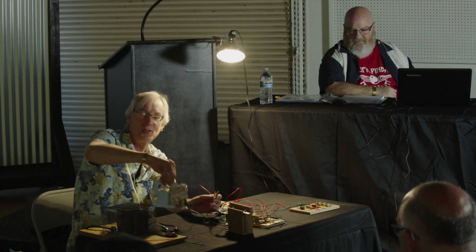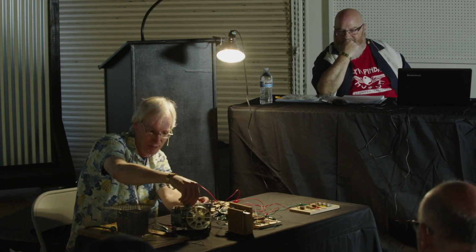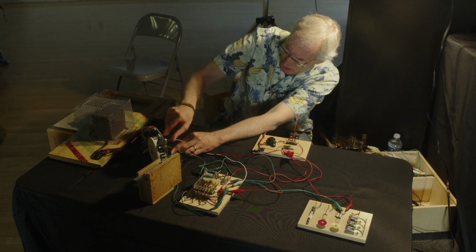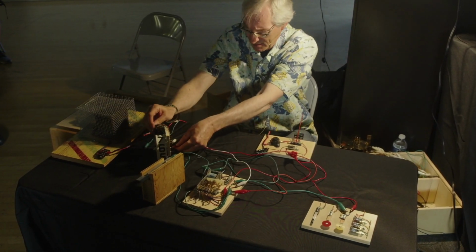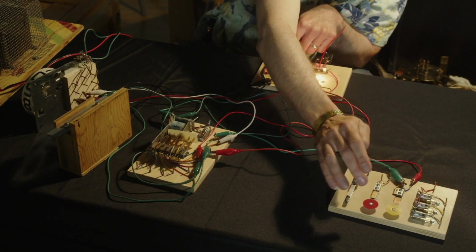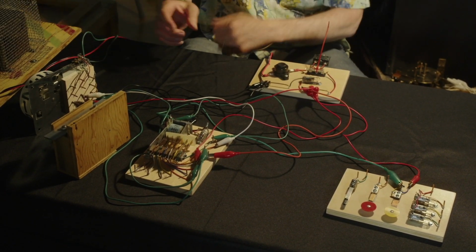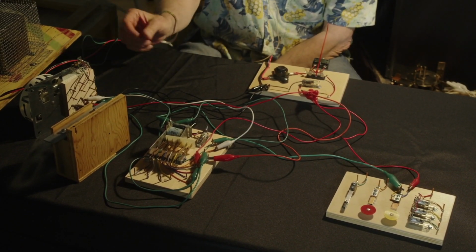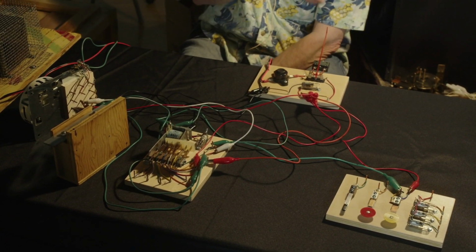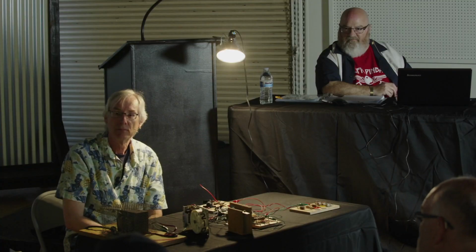So I brought all my switches out to the back of this where I can just clip in without having to find them and label them. So I can grab my end of stroke switch, which is normally closed. And now it's staying on a short period longer than it would have because it's waiting for that plunger to signal back, I've gotten home, you can let go. Why does the last one not happen?